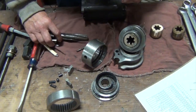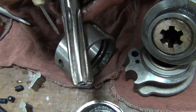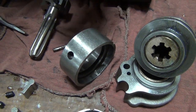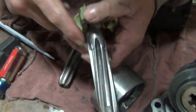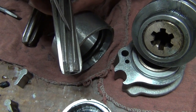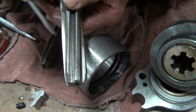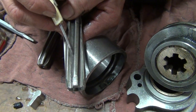Always double-check this real good. On the rifle bar itself, if you follow the edge down, see how this is a brand new piece — nice square top, smooth sides, chamfered edge. On the used one, you can see you're starting to get a little bit of a lip at the bottom, showing some wear, just getting a little narrow. You will see them narrowed way down with time if they've been run with a lack of oil or dirt.